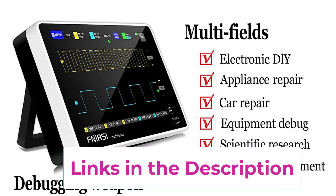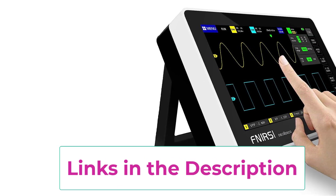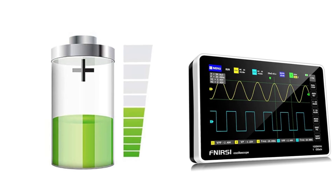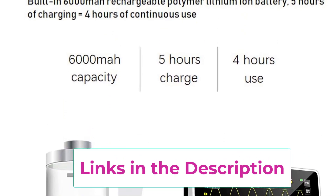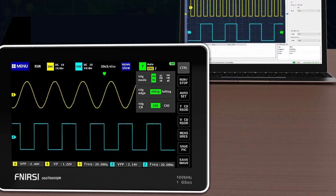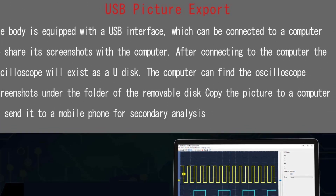It's unique since it boasts a 6,000 mAh high-performance lithium battery that lasts for about 4 hours, which is good enough. This oscilloscope also allows you to take screenshots of the waveforms so you can easily compare the results later on. Thanks to the inbuilt 1GB storage, it can save up to 1,000 screenshots before the storage runs out. It has a real-time sampling rate of 1 GSA/S and can handle signal frequency up to 100 MHz, making it one of the most powerful and reliable options on this list, despite having a low price tag. However, the only downside is that it only supports up to two channels.